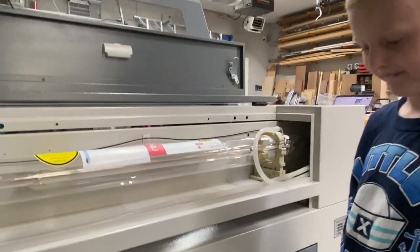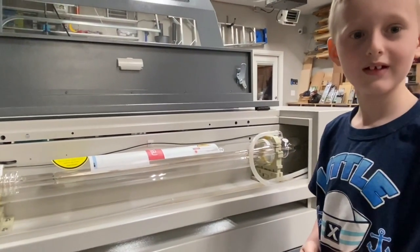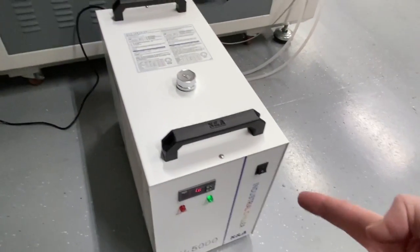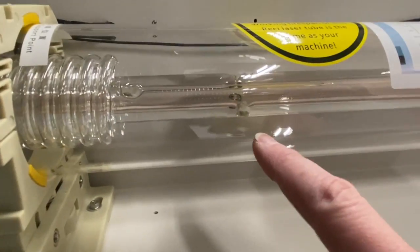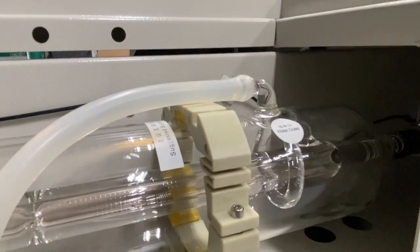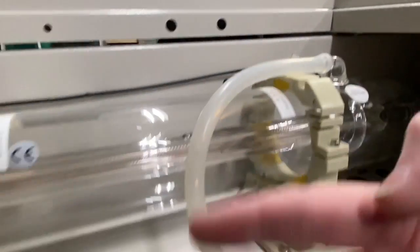The water is flowing inside there. Will that bubble go away? Yeah, it's already beginning to tail off. So I didn't capture it before, but it turns out if you turn your chiller off, the bubble naturally floated over to the exit and up and around, sitting in that curled tube right there. When I flipped it back on, out it went — right out the outlet, right back into the chiller.